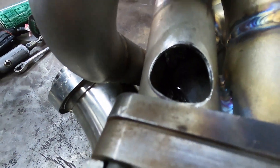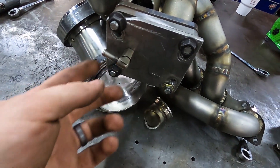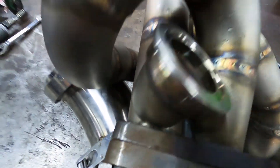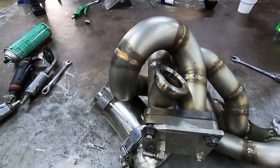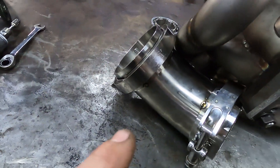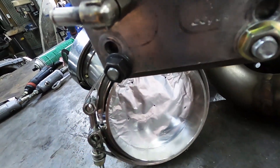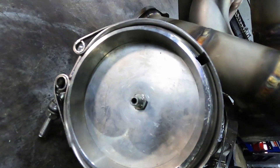We're already over at the bench. I got some foil shoved up inside there — it's kind of hard to see but there's definitely some foil in there. I got my back purge unit and the foil is going to stop the gases from going that way and come this way, and we're going to weld those little beads on here. Just like that. I'm going to go ahead and get some gas back purging and tack that on, weld it on. And while that one's cooling, I got the elbow for the exhaust already all set up. It's got some aluminum foil with a couple little holes in between the V-band flanges. On this side I got my more solid aluminum plate one with a nipple to hook my back purge up to so I can back purge all that.